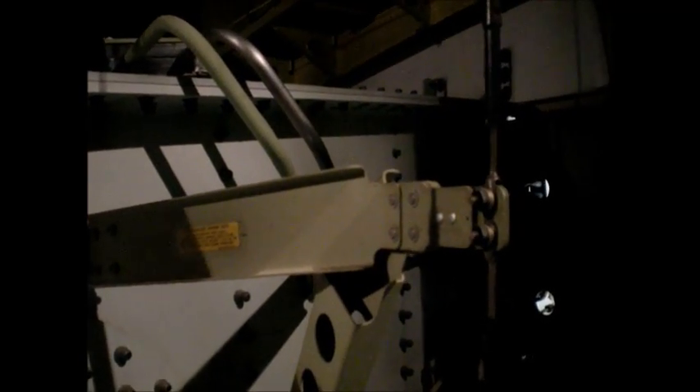These are elevator position sensors. They've got a cable to the bottom and a cable to the top, attached to a sensor up in the ceiling like a transducer. There are three of those on the stabilizer — the cables pull back and forth on the pulley, and the transducer measures the movement and translates that into a position for the pilots to know and for the flight computers to know what the position of the horizontal stabilizer is.